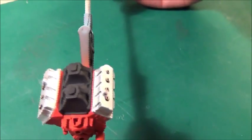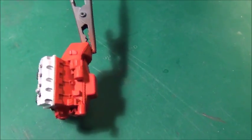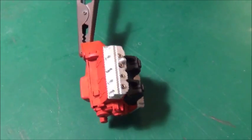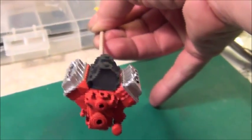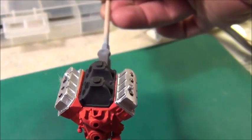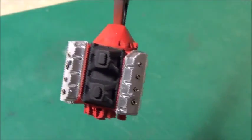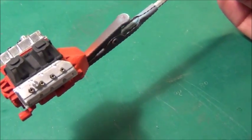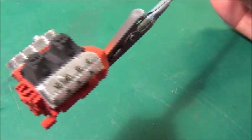All right, here we go. I'm mocked up on a big block. You can see there where I've cut the flange down. I just took some double-back tape and stuck them to this head just to kind of get a look — they fit perfect. You can see all the little details now, kind of how it looks. All I did after I machined that flange was hit it with a little file on the corners and smoothed them up, knocked the burrs off, then took a little piece of sandpaper and slicked up the edges. They're coming out really nice. They could really be dressed up with some fasteners down in the pockets, some boots on these inserts, or even some 90-degree boots would look nice.